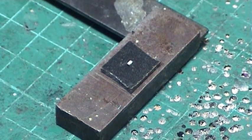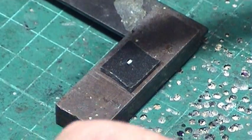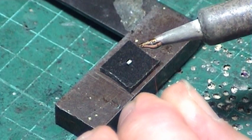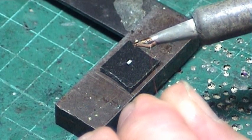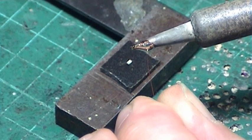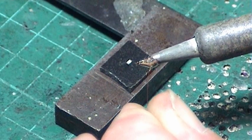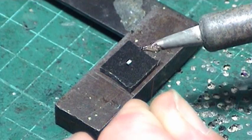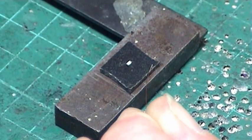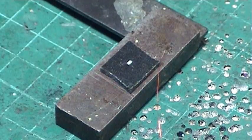What we have to do is get the enamel off the wire, and the easiest way to do this is to put plenty of solder on the soldering iron, put the wire into it, and just hold it there for about five seconds. That will take enough enamel off. If you want more, just move the wire further and you'll see a nice shiny piece at the end.